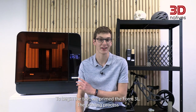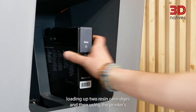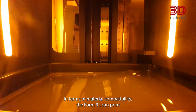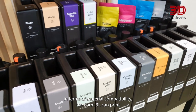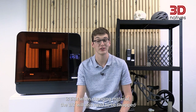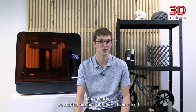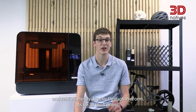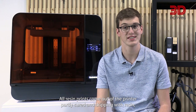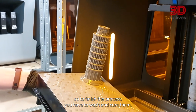To begin the test, we primed the Form3L. The priming process consists of manually filling up the VAT for the first time, loading up two resin cartridges, and then using the printer's prime function, which mixes the resin and prepares the machine. In terms of material compatibility, the Form3L can print up to 17 different resins. One thing to point out is that when changing material, the VAT will also need to be swapped accordingly, meaning you will need one for each material. Once ready, we started our first print, which we sliced and sent wirelessly directly through Preform. As with all resin prints, once printing is done, there are still important steps left — all resin prints come out of the printer partly cured and dripping with resin, so you have to wash and cure them.